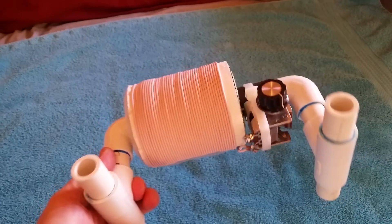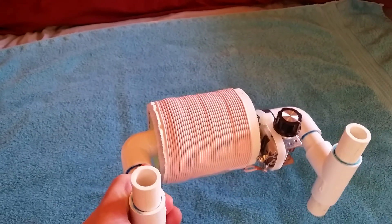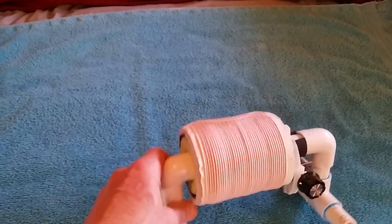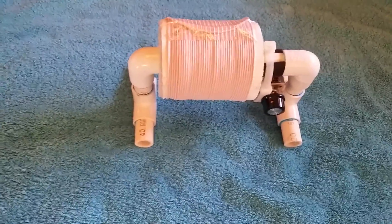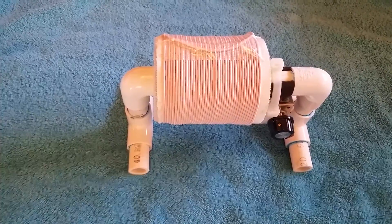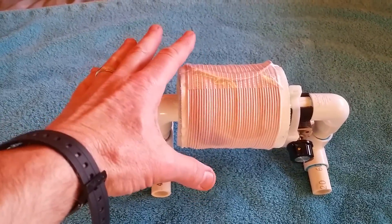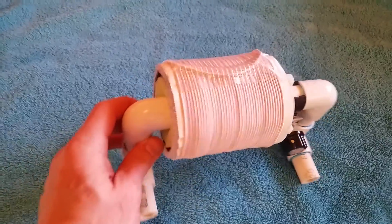Mostly it looks like a coil and variable capacitor. Despite the fact that the ferrite is very thin, this model has equivalent gain to a ferrite rod model of the same length, as determined in FSL design experimentation. The medium wave coil for this model just about maxes out the length of the 100mm long ferrite bars, and this is the highest sensitivity Litz wire, the 1162-46. So despite the fact that this FSL antenna is extremely small and lightweight, it delivers the absolute maximum inductive coupling gain for something this small.